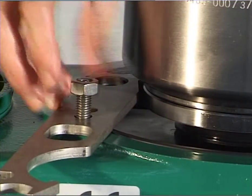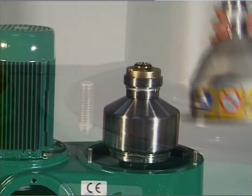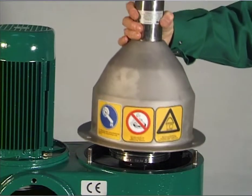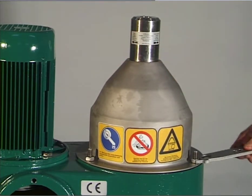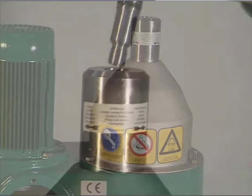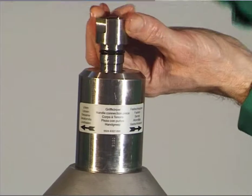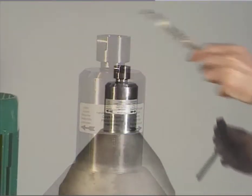Remove the hexagon nut and the hook wrench. Mount the hood. Attention! Two studs — the connection threads of the corrugated hoses point towards the rear. Bolt tight the hood with the two hexagon nuts and a hex head screw. Fit the handle connection piece with fitted gaskets into the hood.